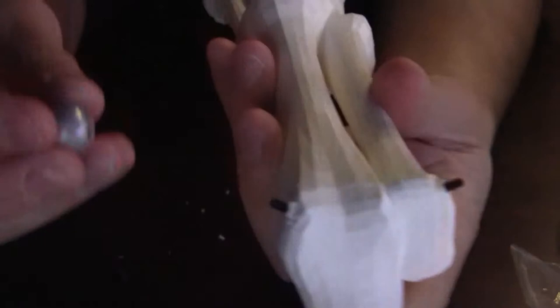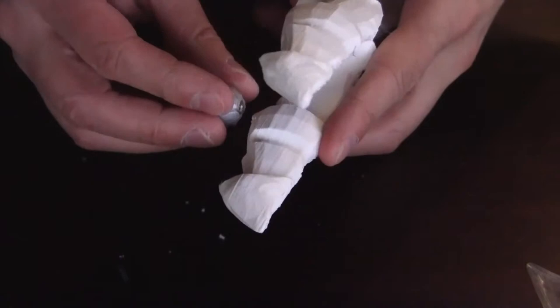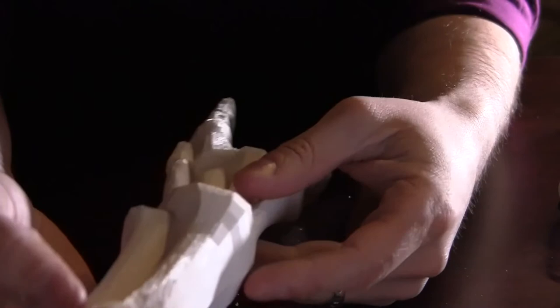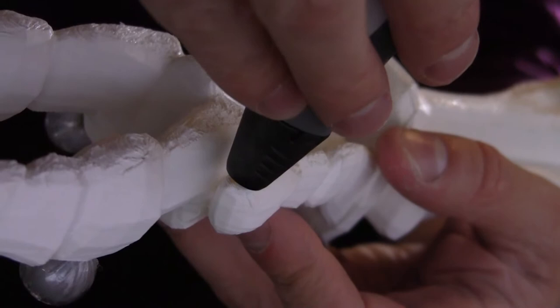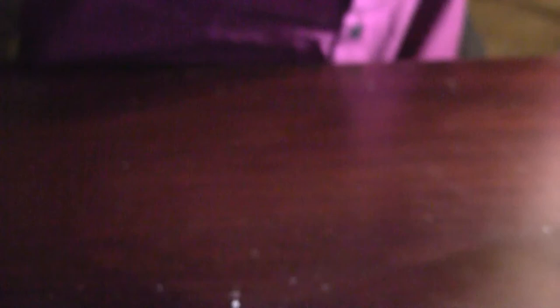The screws easily go on as before, no real problems. You'll notice that these markers actually look different than the other ones — these ones have a special coating on the exterior, so they're a little bit more rugged; I can let kids play with them without worrying about damage. I did run into a problem where in some cases it just wasn't able to finish the outer shell, and this is where the 3D pen comes in very well. Normally I don't particularly like 3D pens — I think they're very difficult to use and I don't have the patience to draw all the lines — but when I just need to fill a hole, I shoot as much extra filament right in there as I need to, then quickly push my fingers into it. It is very hot — between 200 and 235 degrees probably coming out of this filament extruder — so make sure you don't burn yourself.